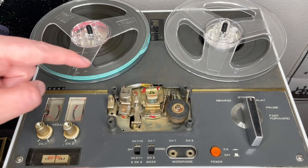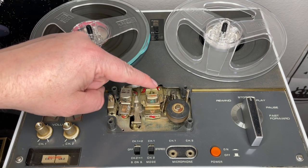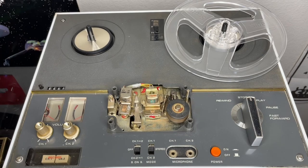This is a two-head deck, so we've got an erase head — it's an electromagnet — and we have the play/record head. If you have a higher-end one, you might have a three-head deck, which separates the play and record heads. That allows you to record tapes and listen to that recording off the tape rather than the direct feed. With this two-head deck, we are going to be listening to the source as we're making the tape, not hearing it off the tape itself.